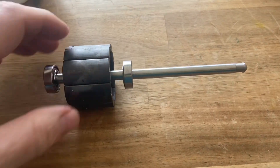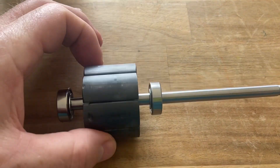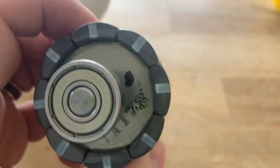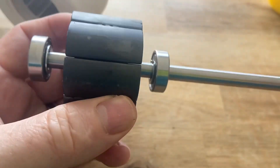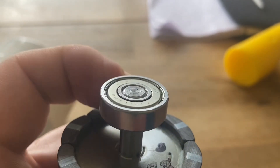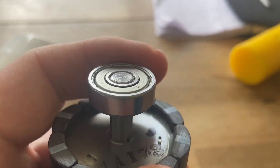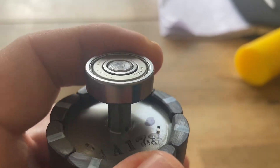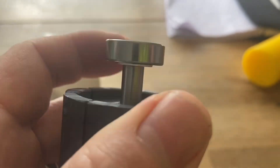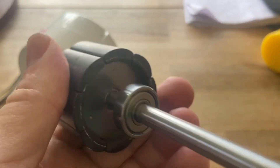You can see the magnets loaded around. So I typically do a visual inspection first, and then we test the actual bearings as well. You'll notice if there's any rocking or unsmooth activity or noise coming from the bearings — you'll know that would need to be pressed out of place. Pretty much standard.